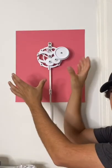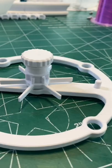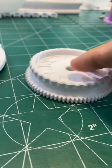I made a mistake on this design. It happens, so be nice. But in my attempt to extend the runtime of this escapement, I made two changes. The first was I added this going train, or this gear train, which helped a lot — I talked about that in the last video. The second change was I went from a smaller diameter spool to this larger diameter spool, and that actually decreased the runtime.